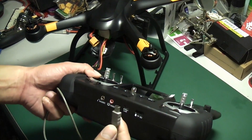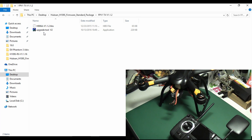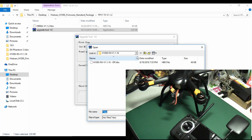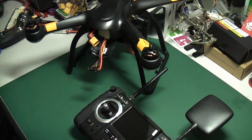Connect it to the port and go to connect to your computer. You will see the FPV1 TX folder — open it up, then open the tools, then press connect. Now open the firmware file, it's called TX version 1.1.2. After that, press upgrade and let it run until success. Now it's successful — close it. After success, the line will turn green. Then power off and remove.